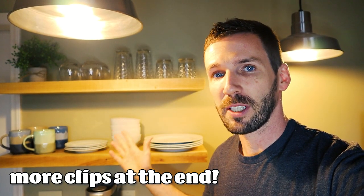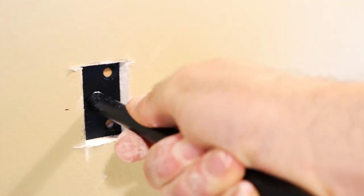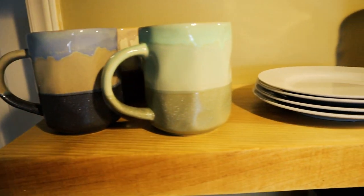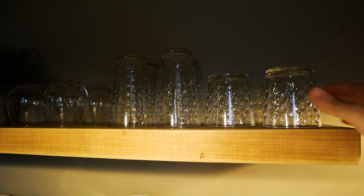And that's all it takes to install these floating shelves. It looks like a daunting task, but really it's not. You just need to fasten the brackets to your studs, and you don't even necessarily need to cover those brackets up if you have a thick piece of wood — this is actually two inches. When you buy a two-by-something at the store, it's really one and a half; this is really two inches and it'll hide the entire bracket. This turned out great — there's no wobble at all and all these dishes are being supported on it with only two brackets. If you're interested in any of these products, they all came off of Amazon and I have the links down in the description. I get a tiny little slice of their profit at no extra cost to you.